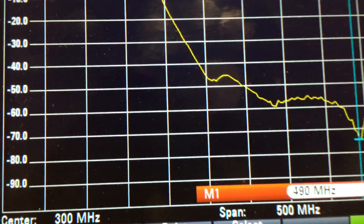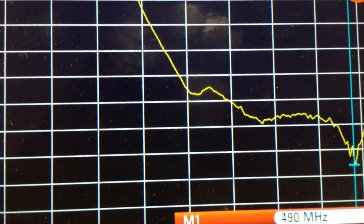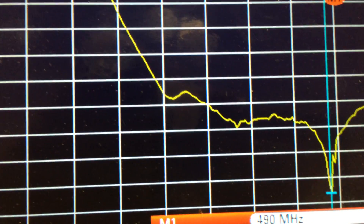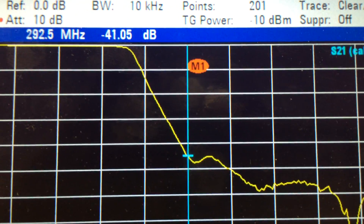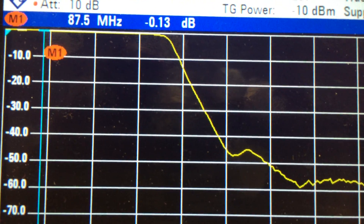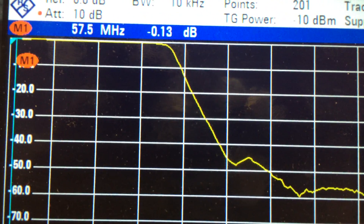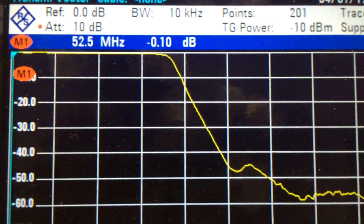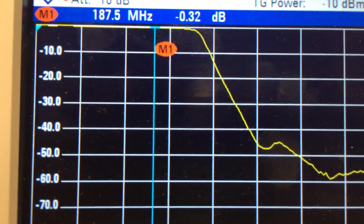The through is fine up to 225 MHz. It didn't go down to the LF end — we're not really interested in that, we're interested in 2m. Let's just have a very quick look — that's 52.5 MHz, so 0.1 dB on 6m. So if you wanted to connect 6m to it on the VHF port, that's okay.